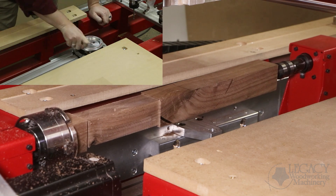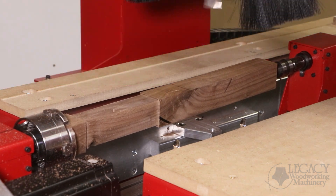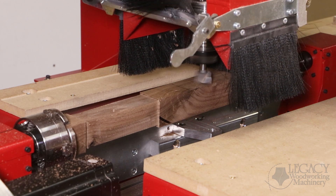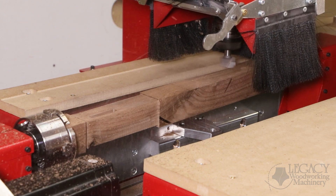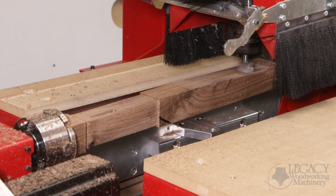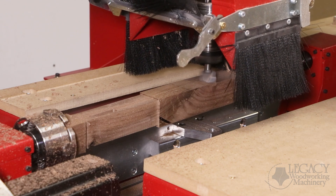On this turning center we're tilting the blank manually to make the tapered plane become parallel with our cutter. That way the cutter can stay at a single plane without having to carve up and down using a ball cutter, which takes usually about ten times longer.